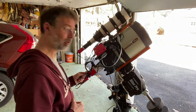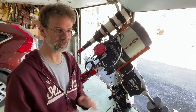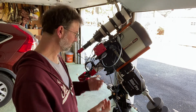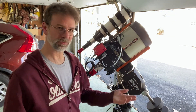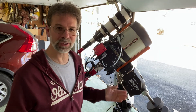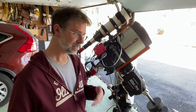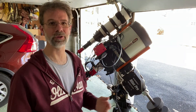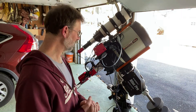There's power — the power button on the EAF is still lit, so I know it's getting power, but I just couldn't figure out the problem. Finally I thought maybe it's the USB cable, so I yanked it off and put a different cable on, and that was working fine. Then all of a sudden it started happening again. So I read online and figured maybe I need to reinstall the drivers. I reinstalled the drivers and redid the firmware, and that fixed it — but then it started happening again. I was just going crazy.